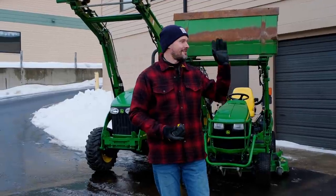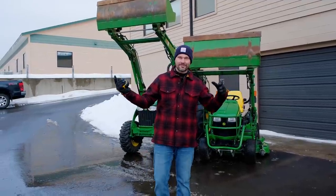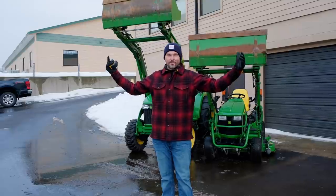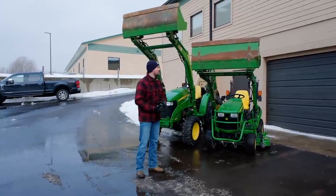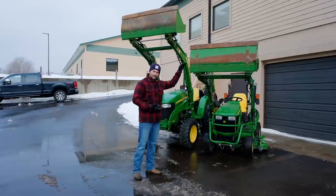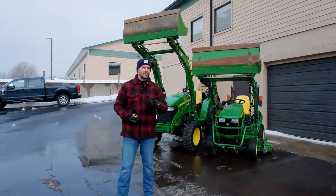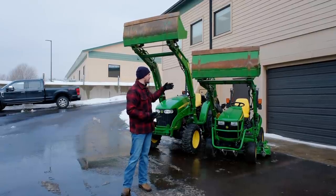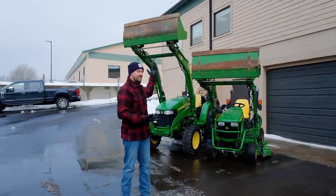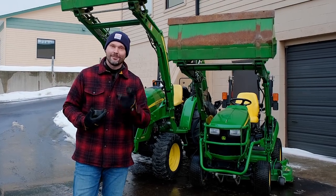It was a summer day. Fortunately it was a Skid Steer Quick Attach, not a John Deere Quick Attach, and the way it was jammed in there didn't allow the entire bucket to fall off — otherwise it would have smashed right on whatever tractor was in front of it. It was a pretty scary situation to have potentially a 500 or 600 pound, 72-inch wide Skid Steer Quick Attach construction bucket hanging up there barely holding on. A customer recently said their John Deere dealer told them an allowable amount of drift down is four inches in an hour.